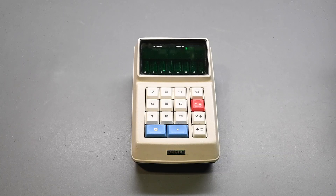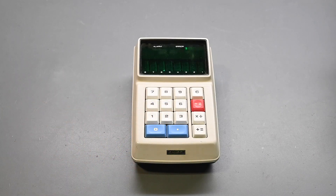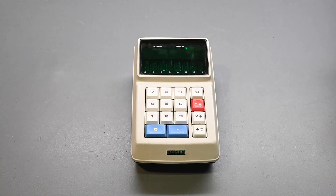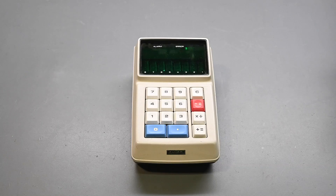Something I noticed on this calculator is that when you touch these keys, they have a very nice tactile feel. Modern calculators use a rubber membrane with a little carbon button that touches the traces on a circuit board. These keys are more mechanical — they use a magnet that activates a reed switch, which moves the contacts when a magnet is brought nearby. All the keys do work, none of them are stuck, so hopefully the reed switches are also working okay.